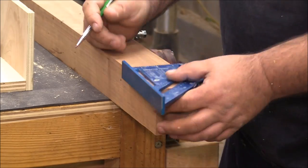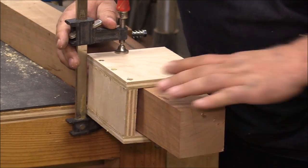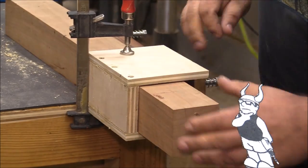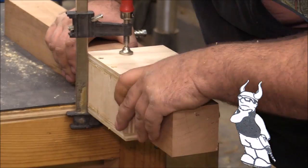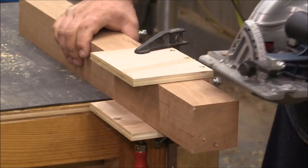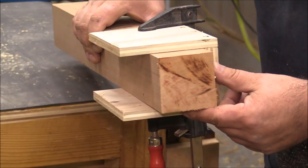After measuring out for the length I wanted, I make sure to measure a setback to account for the distance from the bed of the saw to the saw blade, then clamp the jig in place and make a cut. That gives you a nice clean cut.